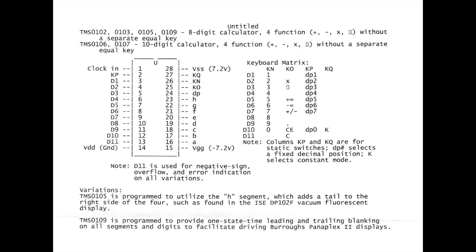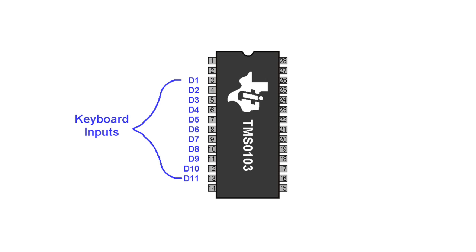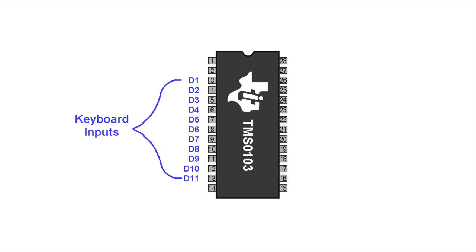This is the information I found, and if you aren't an expert in electronics this probably looks a bit like Egyptian hieroglyphics. Part of what I like to do here on my channel is try to explain this stuff so that it's easier for people to understand. The chip has 28 pins, but we really only care about the input lines for the keys — and there are 11 of them. However, you can see that there are more than 11 keys, and the switch at the top right has multiple positions, so that's like having several more additional keys. So how do they read all of those keys with only 11 input lines? They use a matrix.